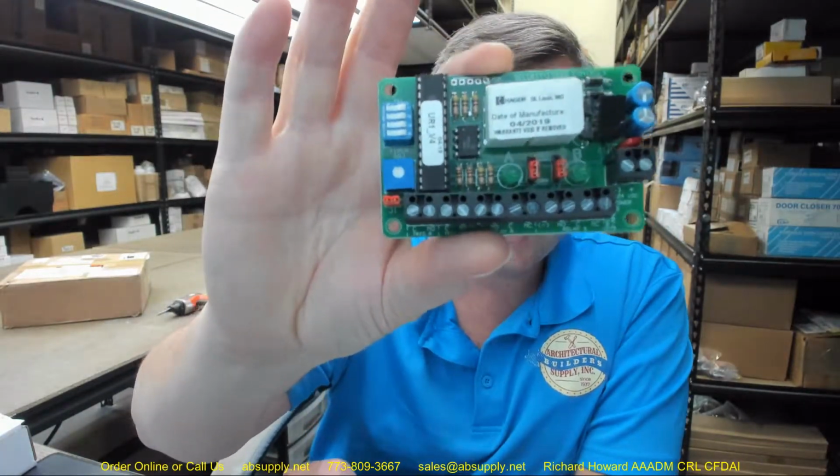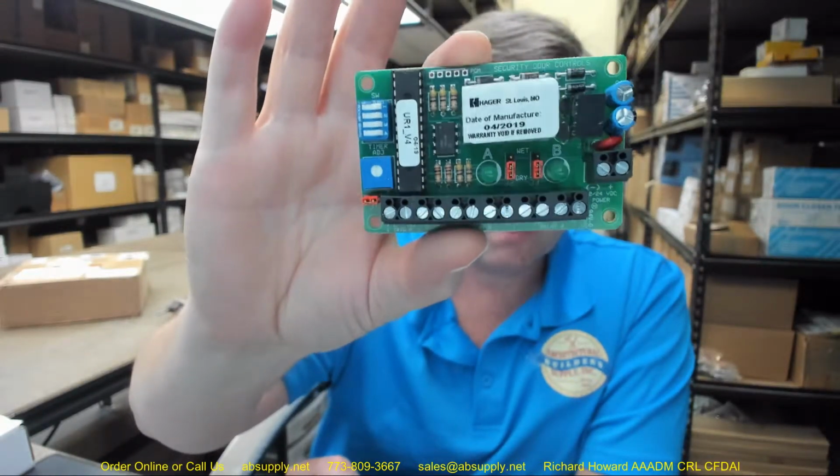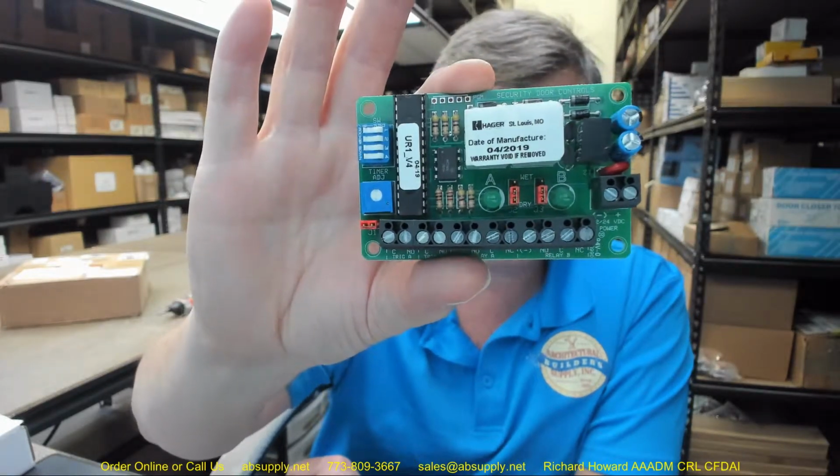So looking at the module installation instructions, thankfully, from this manufacturer, because not everybody, most do, but not everyone does, gives us wiring scenarios for the applications that you're going to use this in. Using it as a relay where you need to be able to power something or control something that would have some power requirements beyond what the 2908 would provide. Microprocessor based relay, we've talked about the field selectable operational modes for one or two doors. Moving to page 2, you'll see a conventional relay mode or a dual conventional relay mode where you're going to run one or two door stations.